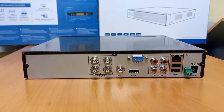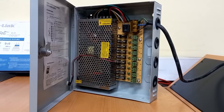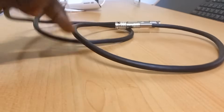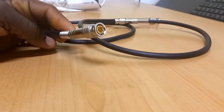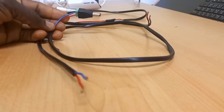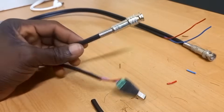We'll also be using this four-channel DVR, to which we'll be connecting our video from the cameras for processing and recording. We need this 12V power supply unit to provide power to all the cameras. For connecting cables, we'll be using coaxial cables fitted with BNC connectors at the ends to transport video from the cameras to the DVR. For power connection, we'll be using power cables fitted with DC power connectors at the point where they enter the camera. We'll also be using a Siamese cable to connect one of the cameras, just to show how it is used.